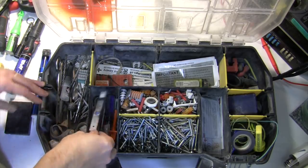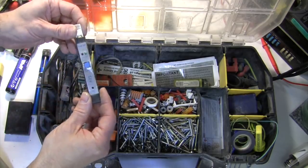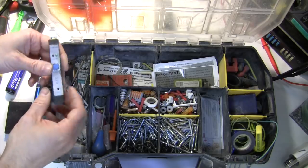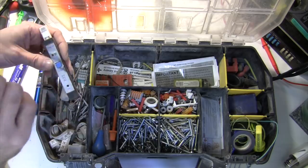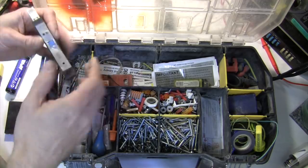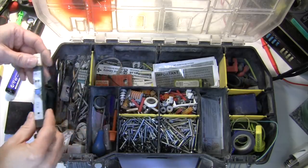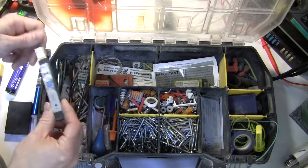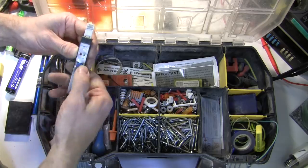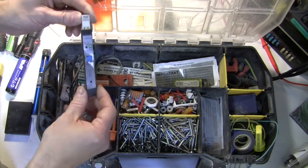This is a telephone socket bit polarity tester. Most people probably don't know you can get the polarity wrong on a telephone socket, not that it usually has much knock-on effect. Back in my comms days working for Mercury Communications, the way some phones worked was that when polarity was changed on the line it caused a red LED to shine on the phone — that's how message waiting indicators worked. The PABX would swap polarity and cause the red light to show. If you installed sockets with wrong polarity in the first place, you'd get the message waiting light on when there was no message. This polarity checker plugs in to show line voltage, a button tests for dial tone, and a reverse polarity light indicates if polarity is reversed.